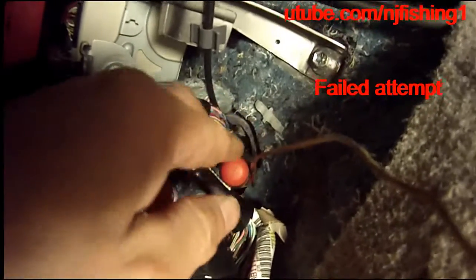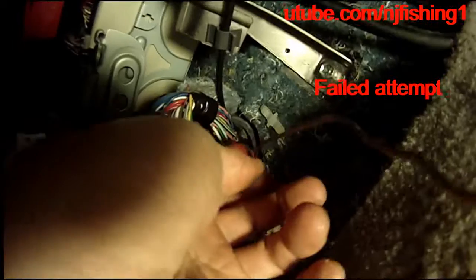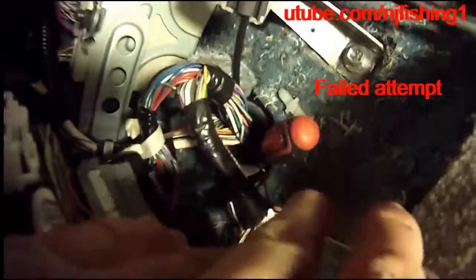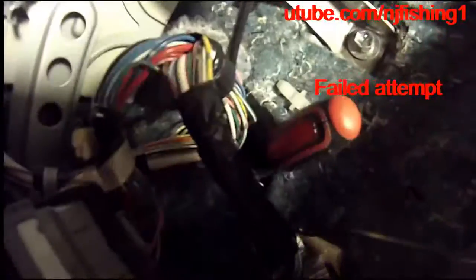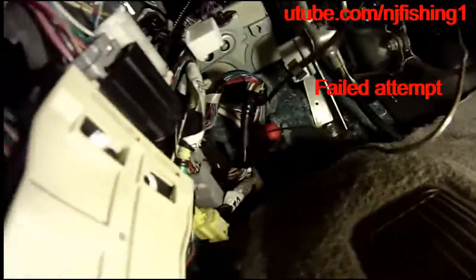This is how I do it: I just poke my screwdriver through the grommet and use my poke hanger following the general direction of the screwdriver. Looks like it went through, so I'm going to go outside and take a look, then try to pull the power line in through there. Now you can see this one is my poke hanger and this one is the screwdriver — the wire is going to go back in from those two holes.